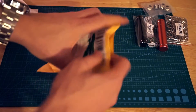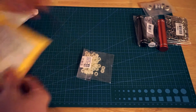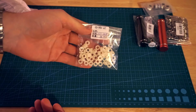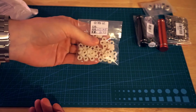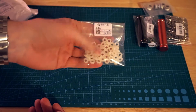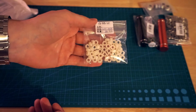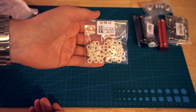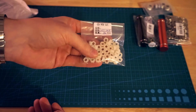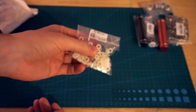And there you have them — nuts. I have a problem with my nuts. These are nylon M5 nuts. I have brass nuts on my P3 Prusa Steel printer and I'm not happy with them — they seem to be wearing down really quickly, which is causing the Z-axis to vibrate. So I thought I would try these nylon ones and see if they wear any better.